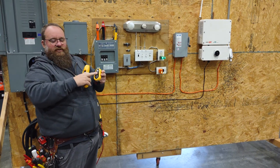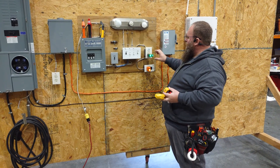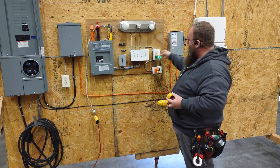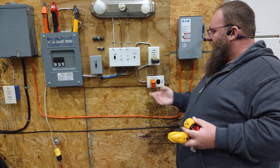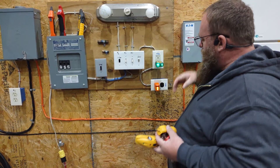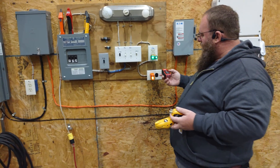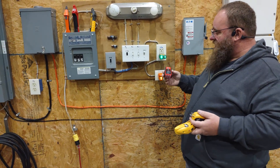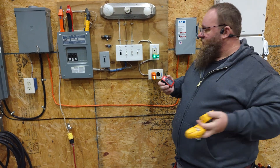They all pretty much work the same now. The way these work is you have a receiver and a sending unit. All four of these units come with the circuit breaker tester — it's actually a GFI tester. You push the button and it trips the GFI to make sure it's working, then you trip it back on. Even GFI plugs down the line work, so you can check if a plug is GFI protected. Now one thing: two green lights on the Ideals means good; two yellow lights on the Milwaukee and the Klein means good. I like the green lights.